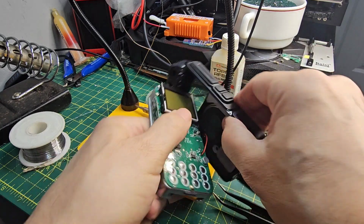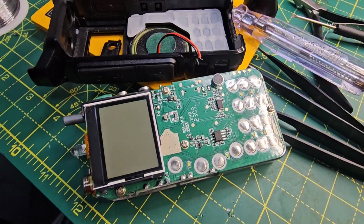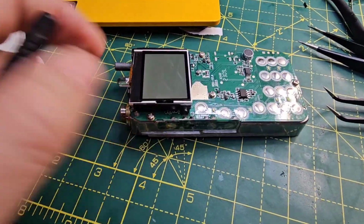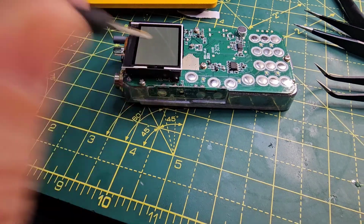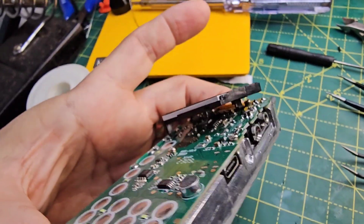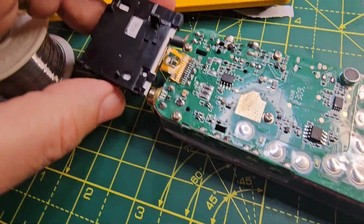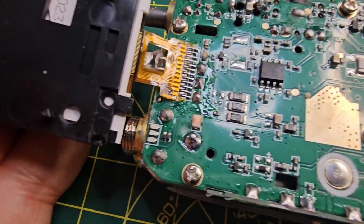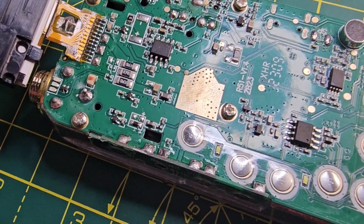And then I'm going to drop a bit of solder there. Just a bit of solder here. I'm going to remove the speaker. I literally just dabbed the solder on and they just came off. So just to flip back the screen, it's only held on one side here. Just get it in there with a small screwdriver like this, and you clip it, and then it comes loose and you can pull it back. As you pull it back, you'll see that there is another plastic clip at the back. So you're going to go back like so, and then put something underneath the edge, not to strain it, because we need to get here and remove that orange coloured item. So I'll just add some heat to it and just carefully take it off.